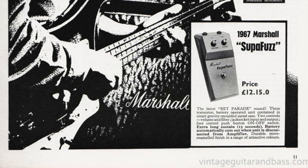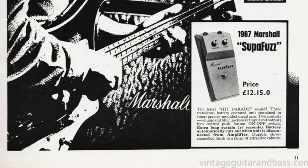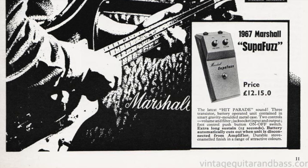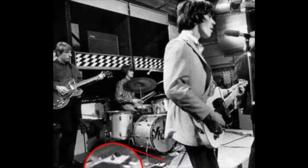The circuit was similar to the Mark I Tone Bender circuit with three OC75 germanium transistors. The fuzz was internally fixed at maximum, and in place of the fuzz knob was the tone control labelled 'filter.' In later production the circuit inside was changed to a modified Tone Bender Mark II circuit with an extra limiting resistor and the regular fuzz control — however, the fuzz control remained labelled as 'filter.' Jeff Beck has been seen using them from 1966 to 1968, both the closer-knob version and the wider-spaced-knob version.